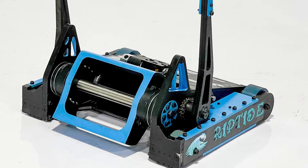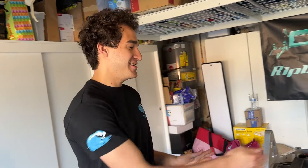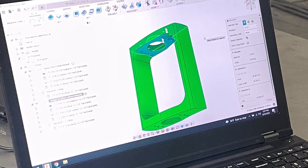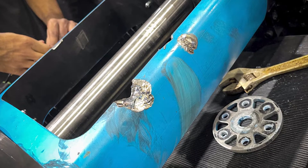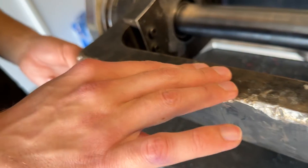Going through the different metals on the weapon system: the weapon shaft is made out of Grade 5 titanium — it's not a short shaft where you could just use steel and make your life easy. We needed the weight savings that titanium gave us. The weapon bar is general 4140 hardened steel. It would be nice to have something like S7, but we wanted to go with soft and reliable. AR500 will kind of cut into our weapon a lot, and you can see there was a huge gash on the weapon bar we used against Uppercut and Bloodsport — it was degrading over time.